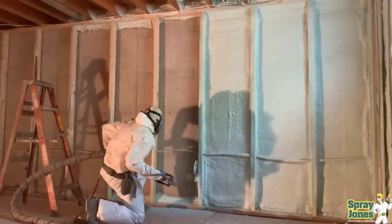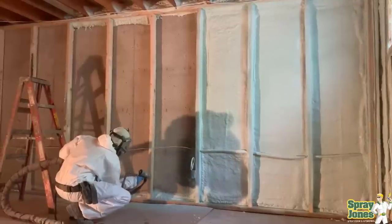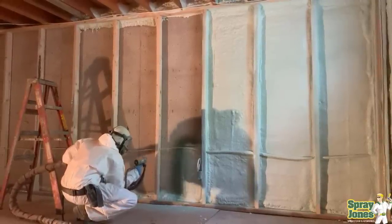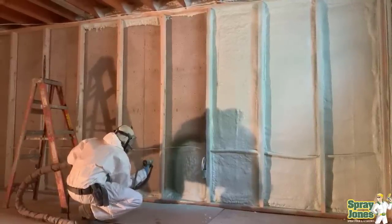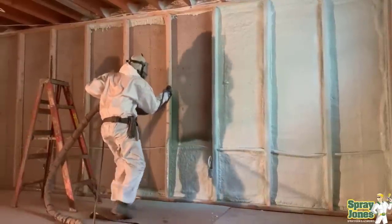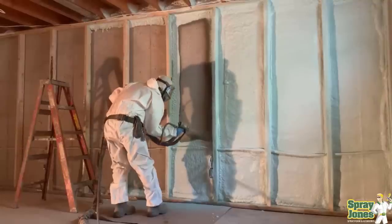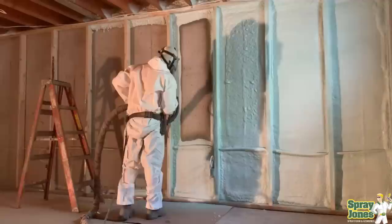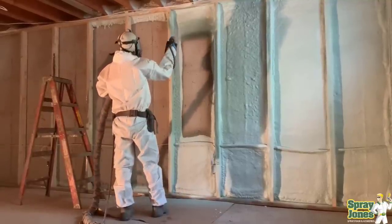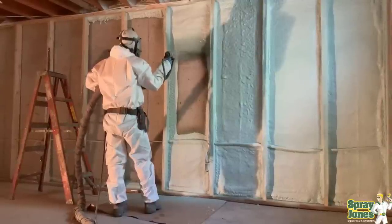The third point is color of the spray foam at the surface level. Sunlight will fade the spray foam quite a bit — it's not UV stabilized, and manufacturers aren't going to spend money on a UV stabilizer. Foams are going to go to yellow, gray, or orange depending on what initial tints or pigments were placed in them. For instance, BSF in Canada has a purple foam that goes to gray within 24 hours in sunlight. Huntsman and others that start green fade to yellow and then orange within 24 to 72 hours of direct sunlight.